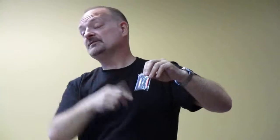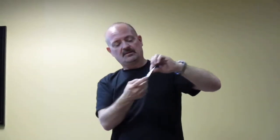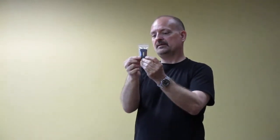How I did this, I used aircraft aluminum 6061, actually 7075 is what I used for it, and machined it out. I anodized the entire thing red. The blood red for Deadpool was a combination of multiple dips of different shades of red and black, to get that dark red.